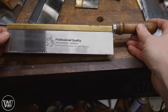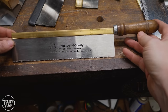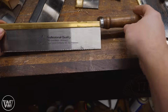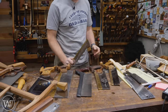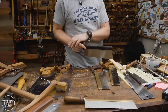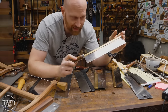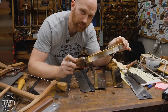This saw I like to joke is banned by the Geneva Convention — it's called a gent saw. It's not really banned, but I absolutely hate these things. It is a back saw because there's a back on it, but it has a straight handle which just makes it feel weird. If you work with a really low bench, it's nice, but at any normal bench height this handle is just annoying. Putting the handle at an angle lets your arm come up and cut at bench height. These are incredibly cheap because nobody wants them, though some people do like them for dovetail work and fine joinery.